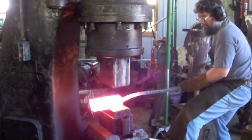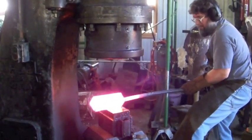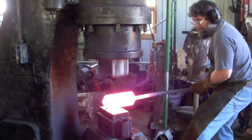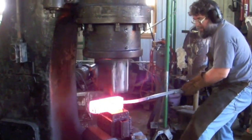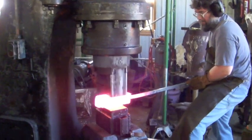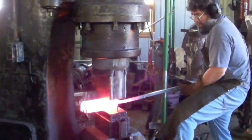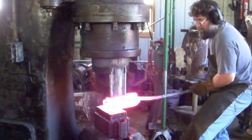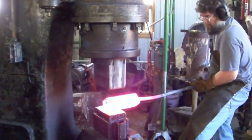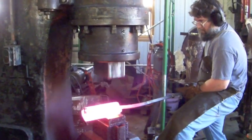I'm going to reheat. It's bouncing quite a bit here. What I should have done is used a pair of tongs close to the billet to gain a bit more leverage. The handle is hot from the forge and I couldn't grasp close enough to the billet to get a good mechanical advantage and leverage on it. So it gets away from me a couple times here, but that happens.